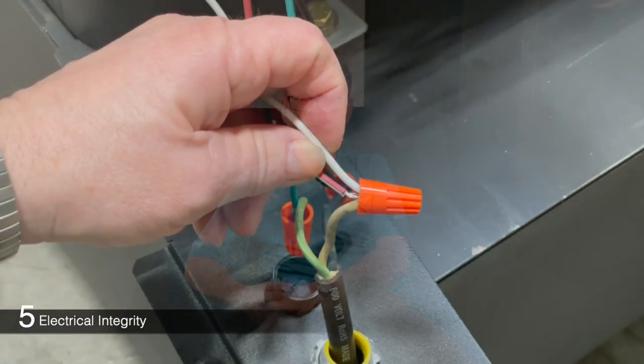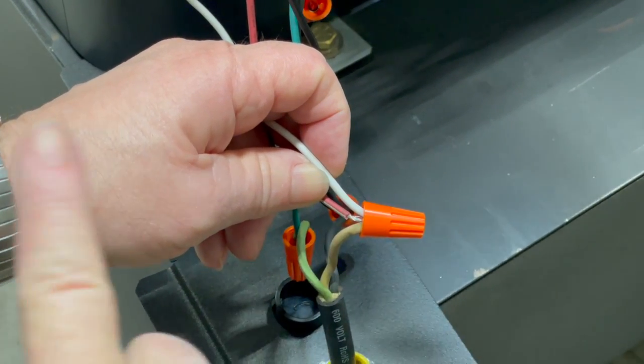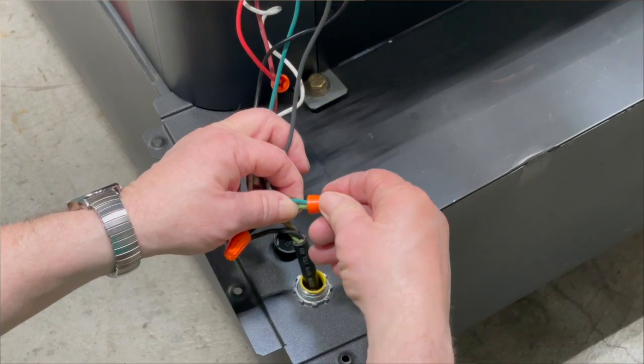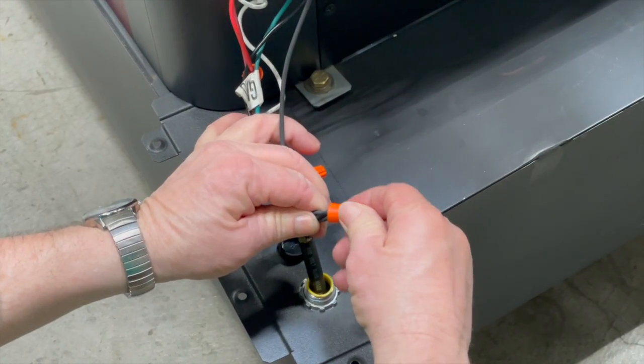Check all electrical connections, ensuring that they are secure and free of exposed wires. This includes screw-down termination blocks and wire nuts. Wires don't shrink, but the wire covering might. This could create wire exposure at the ends, which could cause a short or a shock. In a more extreme case, the cover shrinkage could cause the wire to dislodge. Make sure all your connections are intact and tight.